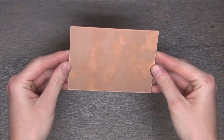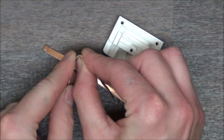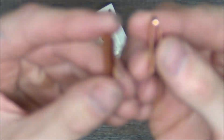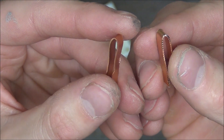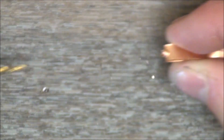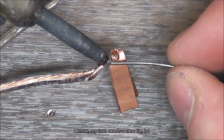But first, I'm going to take this sheet of copper and cut two strips from it. We're then going to want to bend these pieces to fit into our connector piece and cut them down to length — like this. Taking a drill, we can poke a hole through the bend, and then take some 18-gauge cable and fish a wire through the hole, soldering it in place.